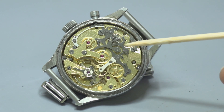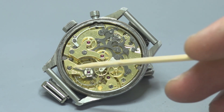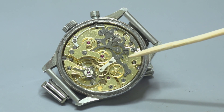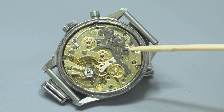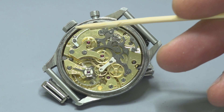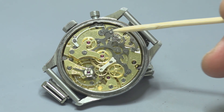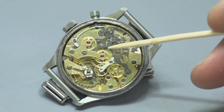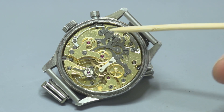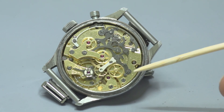It's quite clear when you look at this movement that the 15 CHT was derived from a pocket watch movement — an earlier movement made by Lemania — and it was also developed in future years into the Lemania 2220 movement used in the later Series 3 chronographs. It's also worth noting that although this is the single pusher version, they also made a two-pusher chronograph version called the 15 TL. Lemania movements are known for their exceptional quality and this one is no different. The fact that they based it on a pocket watch movement means all the chronograph components are made at a fairly large size for a wristwatch, which has increased the durability and quality of the movement. It is a really well-made and well-designed chronograph complication. It's always a pleasure to work on a watch like this where the large components are less prone to wear due to the greater surface area.